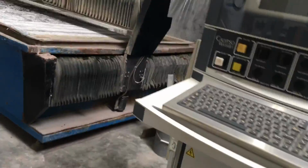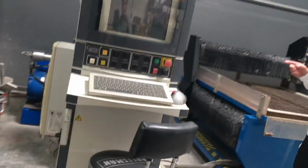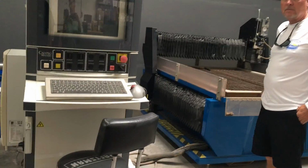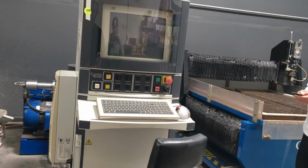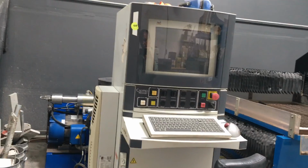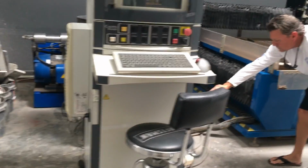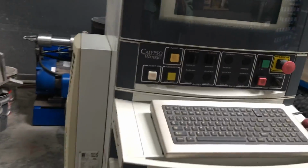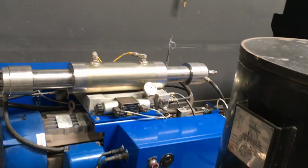Maybe that doesn't require 100 amps, but I think it does, just because of the pump size. KMT would be able to tell you. No, maybe it's 70 amps. Well, did the spec say it? It says 30 horsepower, 60 amp is the spec that's out there. I don't know if you put it on yours or it was on the other. I didn't touch any of that, but I wonder if maybe this smaller unit requires less than the 100 amps. But it's the same pump. It's 60 amps. 30 horsepower, 60 amp, 460 volts, and that was 230 volts.